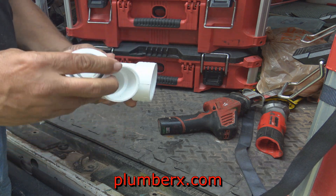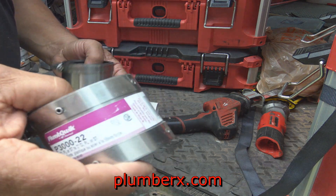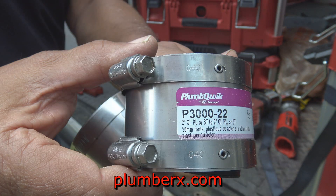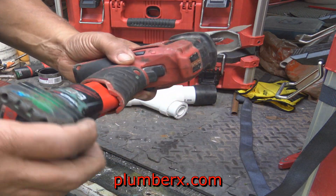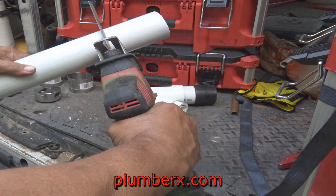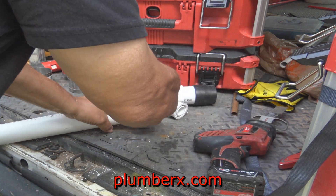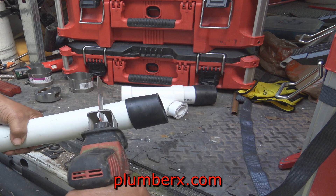We're going to get started. What I'm going to do is prefab a piece that's going to fit right where I want the discharge to go. In the field we call these mission bands. This particular mission band is two-inch — you can read the label right there: it says two-inch CI/PL, which means cast iron or plastic, so it's made for PVC pipe or cast iron pipe. Prefab means nothing more than getting it ready to go in place rather than trying to build it in the spot, so I can just walk in there and make my cut.